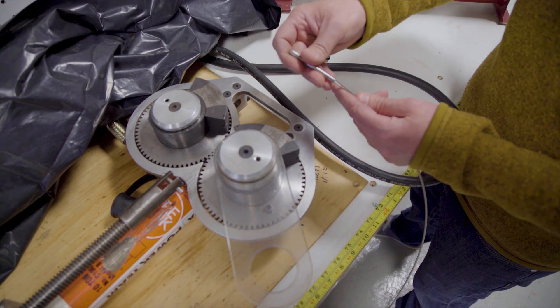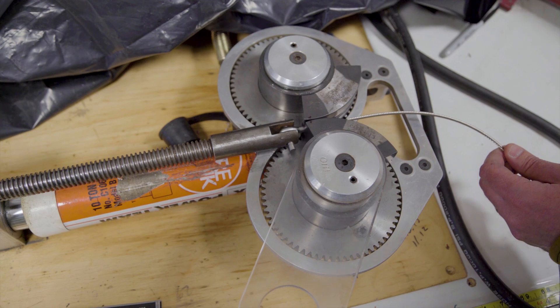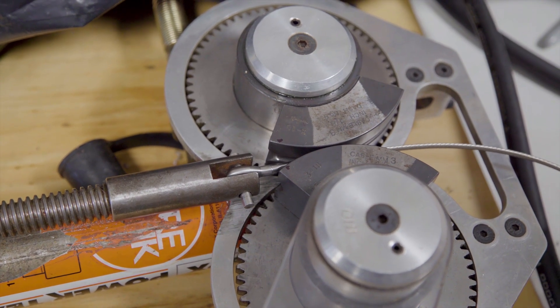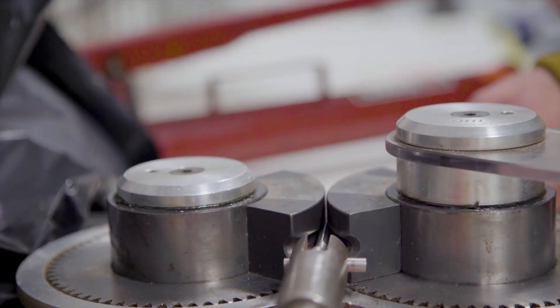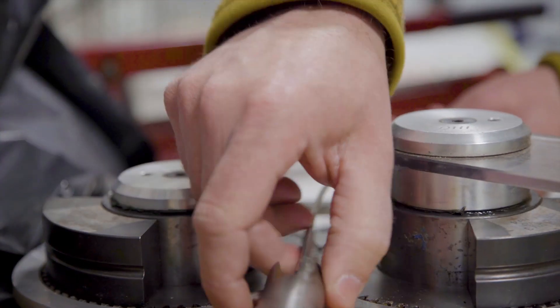Same kind of thing for standing rigging. You're cutting wire, measuring exactly, making your deductions for how much it's going to change while you make it. When standing rigging is made, we use a process called swaging to add a fitting onto the end of the wire. We actually crush the fitting and deform it so that it grabs the wire and holds on. We have a hydraulic five-ton ram that pulls the fitting through two metal assemblies called dies, which deform the swage fitting around the wire and crush it so that it sticks to the wire.